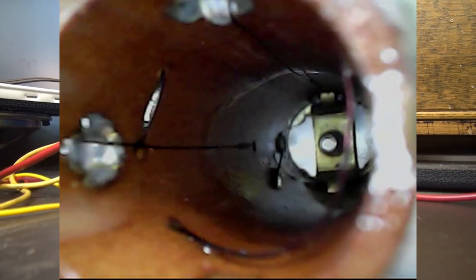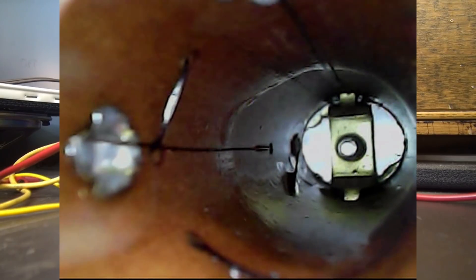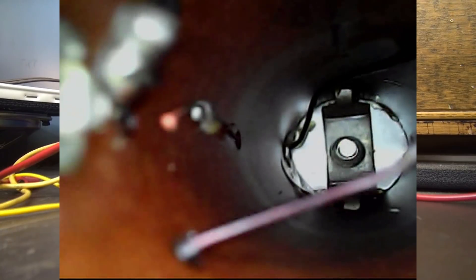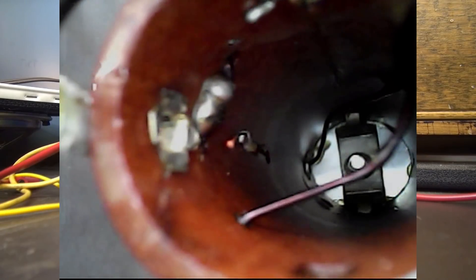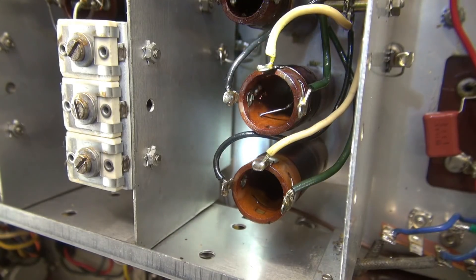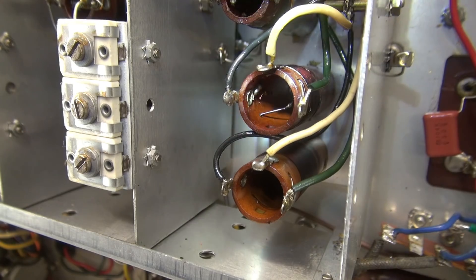Let's take a look at a normal RF input coil — you can see that little wire coming from the center up to the terminal, that is normal. Now let's take a look at an abnormal coil. Got that wire coming out of the center — see the solder glob on it? See these other solder globs? This one was damaged long ago and somebody attempted to repair it. From my inspection scope, somebody did try to repair this at one time. Hopefully I can go in there and lay a little wire runner and attach to that solder glob. I've done this before and had great success.